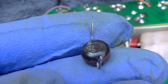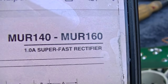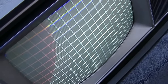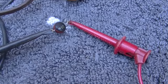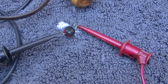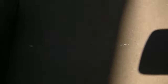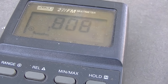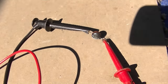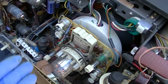This might have been selenium. It's a one amp super fast recovery diode. It's looking good. I guess we just have to watch it and see if it flakes out. Interesting — this one tests good. Maybe I'll set it in the sun to see if it flakes out with heat. A minute in the sun and it went open — I'm going to freeze it. Yeah, the diode is bad, a hundred percent confirmed.